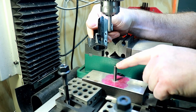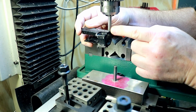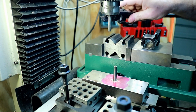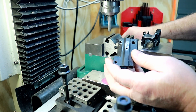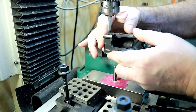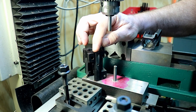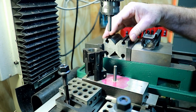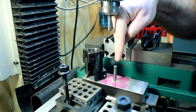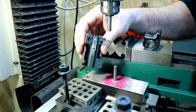You would have to compensate for that if you had a setup like this — maybe a pin here. You can tell this one is slightly tapered even though it still doesn't fit. You may have to sand it, file it, or whatever while it's spinning in there until it fits. I used emery cloth in a lathe and got them where they just fit. Not every single rifle trunnion's hole will be the exact same — they're not precision, they're not going to be within a few tenths. They're going to be a few thousandths off. But this is the best way I've found to align the two pins, get everything lined up, and drill a perfect hole.